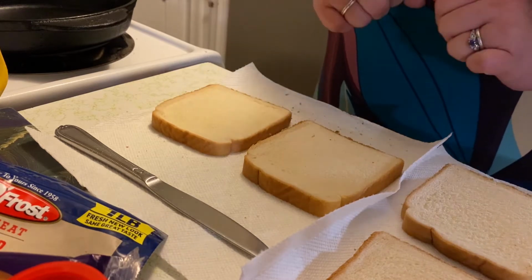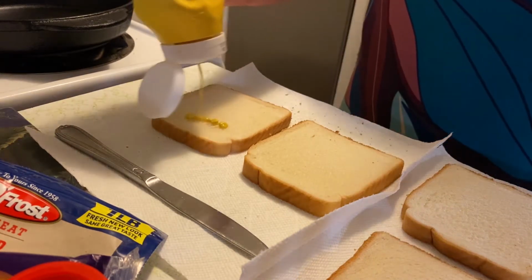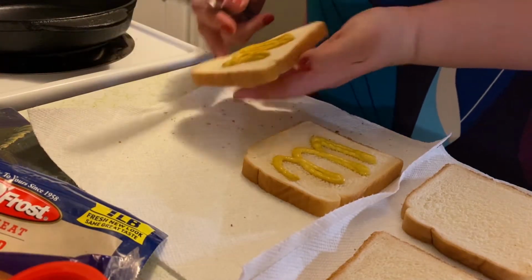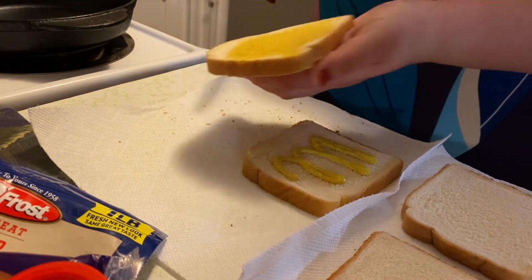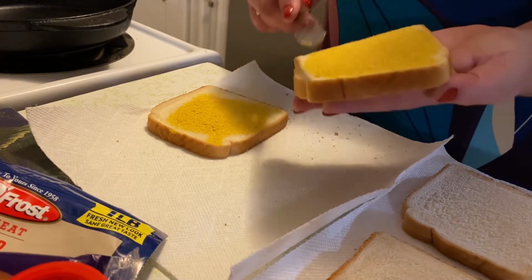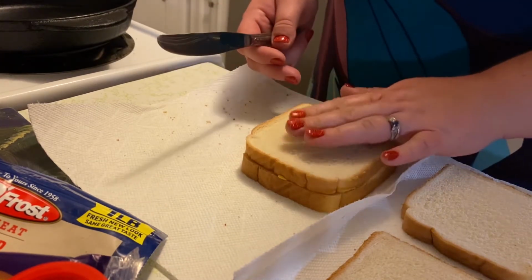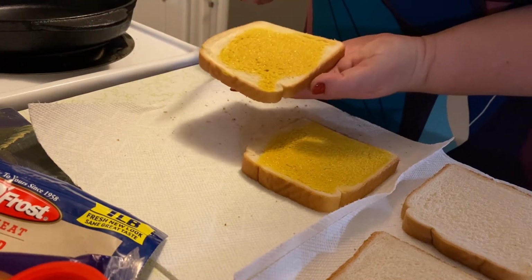But before you cut out that top piece of metal, you've got to flow solder on it. But here's the part that confuses everyone. You flow solder on the back side of the top piece, kind of like with the sandwich. The mustard makes everything in the sandwich stick together, but where do I put the mustard? I put it on the underside of the top piece. I don't put it on top. So you're gonna flow solder on the underside of your top piece.